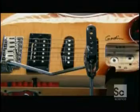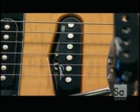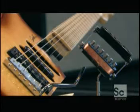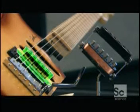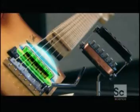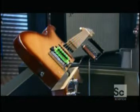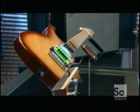But tone and volume mean nothing if you can't hear a thing. The pickups are key — they really pick up the strings' vibe so they can be amplified, all using only a few magnets and a coil. The pickup's magnets produce a stable magnetic field, until the guitar is strummed and the vibrating metal strings disturb that field, inducing an electric current in the coil. The current fluctuates in keeping with the movement of the metal strings. So if you pluck the A string, it vibrates at 440 cycles a second, or 440 hertz, and that will induce an electric current of the same frequency in the pickup.